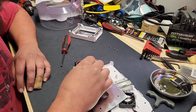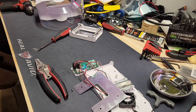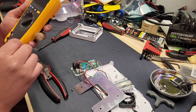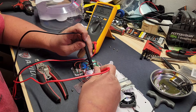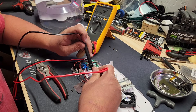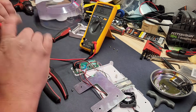Interesting — it's on the ground side, or the earth side. And actually, while we have an open circuit, I'm going to test to make sure we got continuity across this thing. We're reading for ohms. That's no bueno. Okay — 5.3 ohms. That seems about right for something like this, a little resistive heater. So that's good.